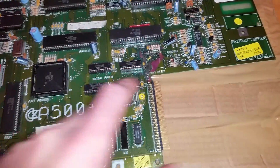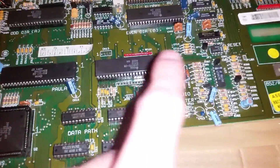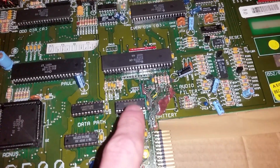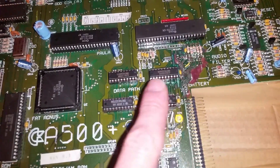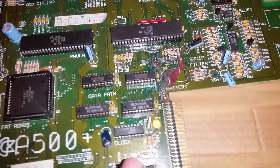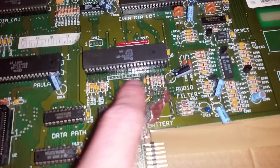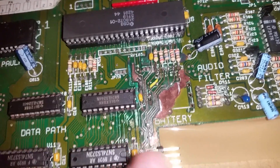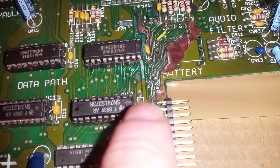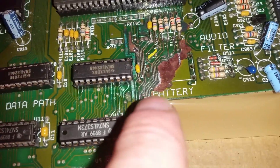The battery has gone all the way through like I showed you on the board. This socket was rotten. I re-socketed that, re-socketed that, changed these - they're all new. Re-socketed all of them in the end out of frustration, and haven't done any of the caps or anything. Replaced all these resistors and capacitors here, had to bridge that capacitor onto what's left of that trace there to patch up some of these traces.